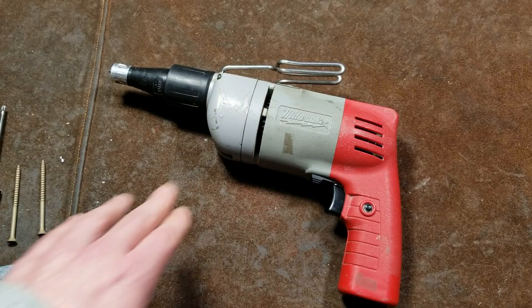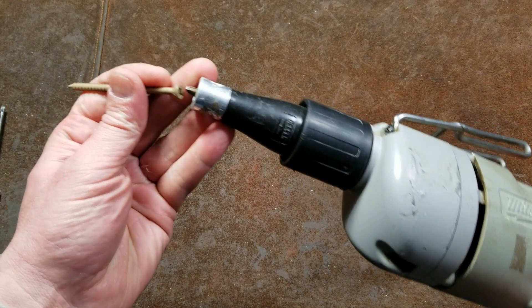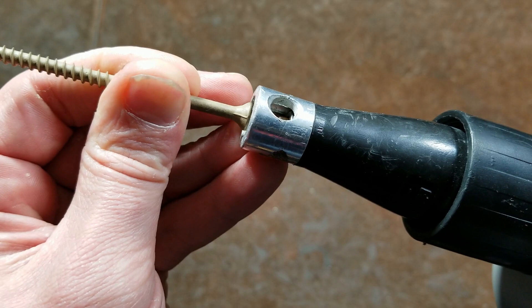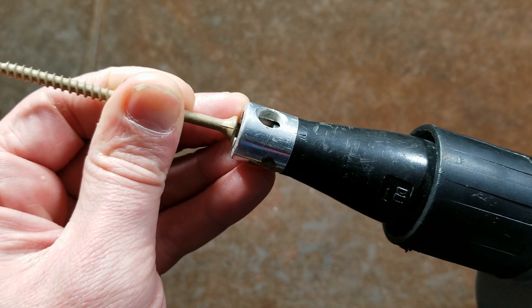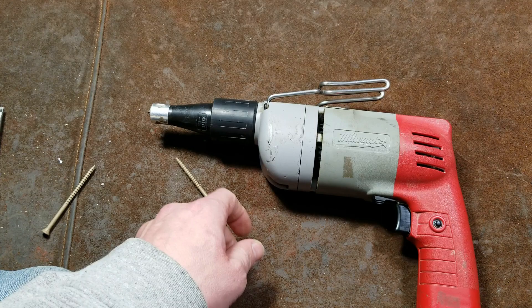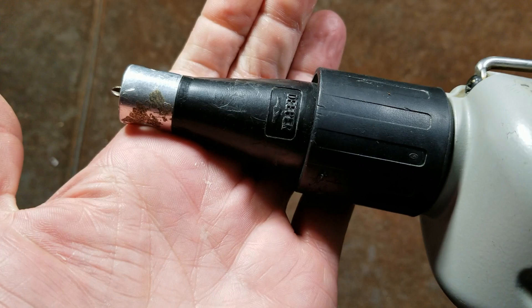I want to point out a quick tip for setting the depth on these. You can drive a few screws to get them going, but the best thing is to push a screw in and find where the clutch is not going to engage — that's where the teeth are on top of each other in the clutch. That's the easiest way to set the depth. You turn this collar back and forth until it reaches the right depth. Sometimes they go a little too deep and you just back off a notch, or advance a notch if you want to go deeper. This one does have a little arrow here.